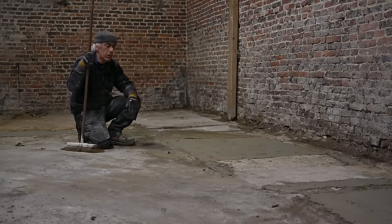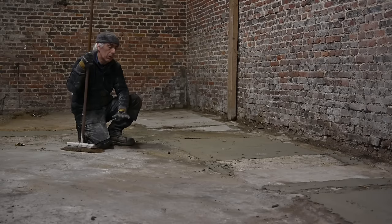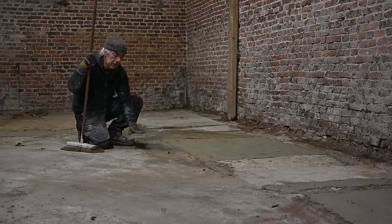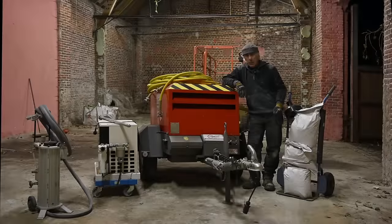The floor is now patched up. Of course this is not concrete as such — it's a one-to-four ratio of cement and sand. There's no metal inside and no net inside, but that's not necessary because I filled it all up with bricks. It's just to make it even. On top we'll have a plastic foil coming all the way across the floor to protect from humidity, then a steel net, and finally the concrete on top — about 10 centimeters — which will then be polished. But that's not for now. Now it's time to clean up the walls.